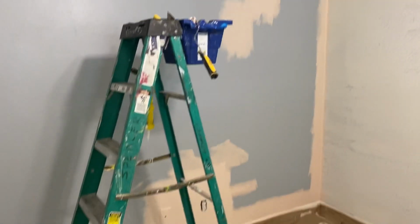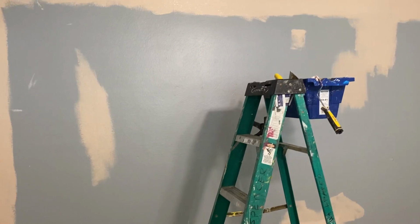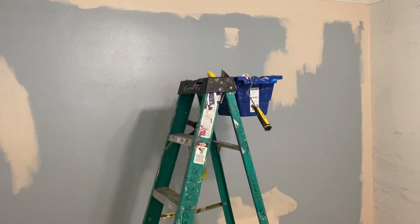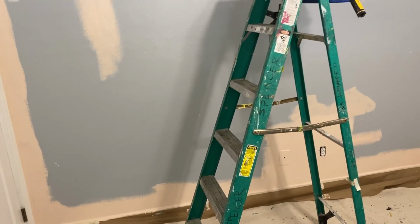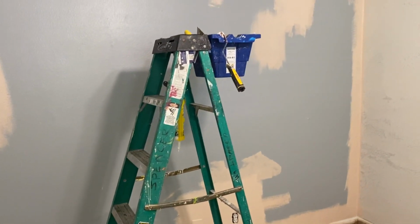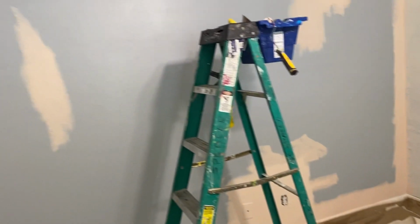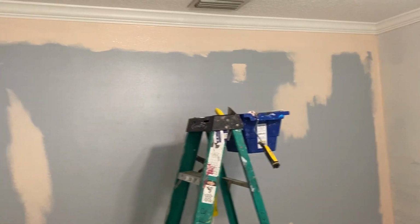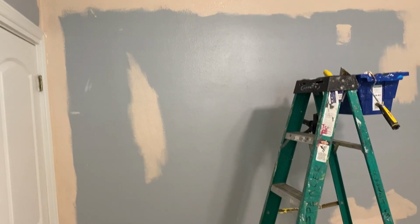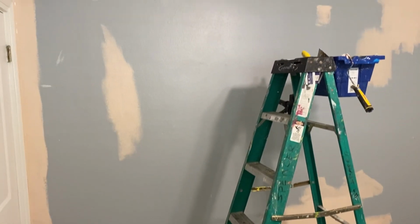Now we get to painting the wall speedily with a 9-inch roller, or perhaps you have an 18 or a 14. Our perimeter is done, right? We've second coated our perimeter. If you haven't, you want to give it 2 coats. You never want to paint anything with 1 coat, please. I really can't stand when people say, oh, this paint covers in 1 coat. I hear homeowners tell me that, and I say, oh no, I don't paint with 1 coat. It never covers.